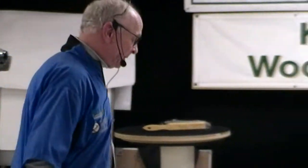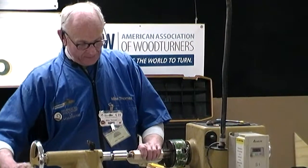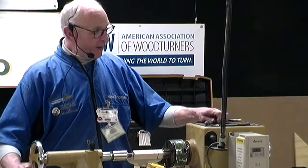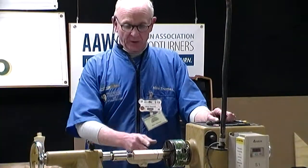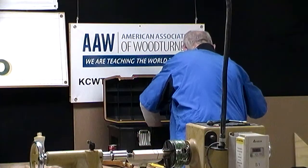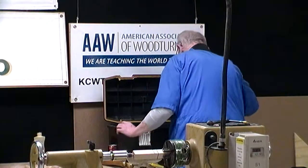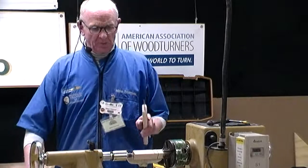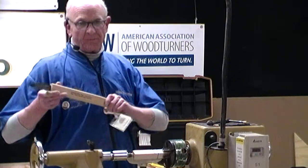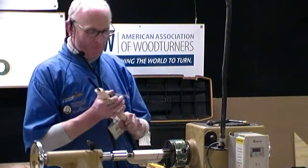So anyway, to prevent that, put the tailstock up with the live center right in the center of the wood. Then we just have to part the cap from the body. And to do that, let's see here. There's only one good way to really make this cut successfully, and that is to have a homemade thin parting tool,